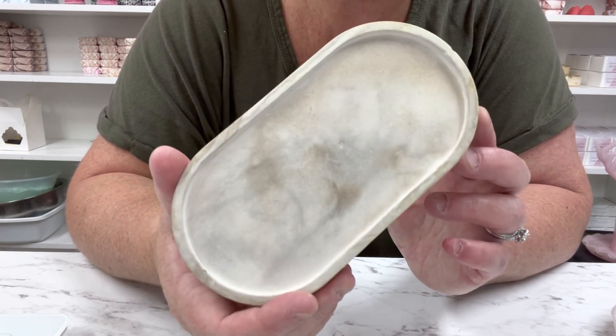All right, I am back. This is what it looks like — it basically looks very similar to concrete but it's lighter, which is kind of good because I want a lighter finish. In here I have 180 grams of Hydrastone powder and then 60 grams of water — so that's three parts powder to one part water. It says you don't need distilled water — I'm going to use normal tap water. This is only a test. It takes about 20 to 30 minutes to dry, so it's super fast to unmould, and then it gets harder after a few days.